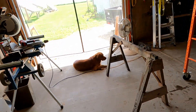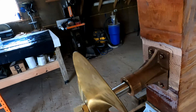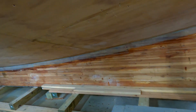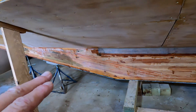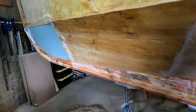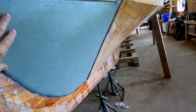We've got a few updates for the week — the prop is on there, the outer bearing housing is mounted, we've got the one inside to do, and we're planning on doing that later today. Let's get the stuffing box mounted. I got most of this done, but I decided to stop and get this area up here done first. So I got this piece of glass on here — which wasn't easy, by the way — and now I'm putting the 1708 on here. At the moment I've got four layers of 1708 on there.